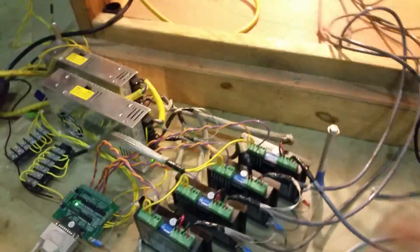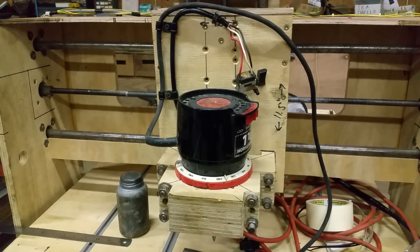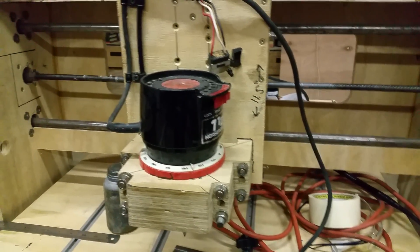After doing all that — amazing results. I couldn't believe it. I got everything hooked back up, fired the machine up, and the motors are super silent. When I run the axes back and forth they're not whining, not making any weird buzzing noises — super smooth operation. It just blew my mind. At full speed all you hear is silent motion. Before, it was making a really high-pitched ring, maybe around 12,000 Hz, with a pretty loud hum. Now — super silent.